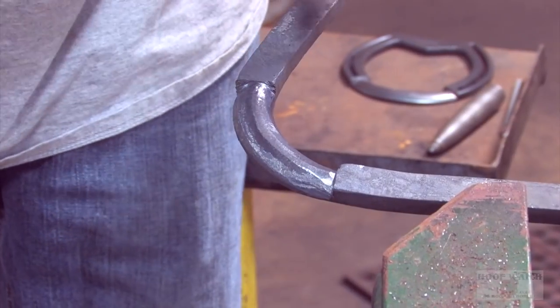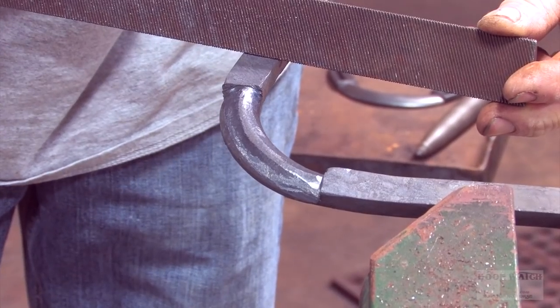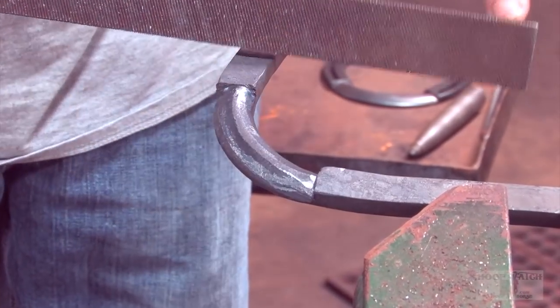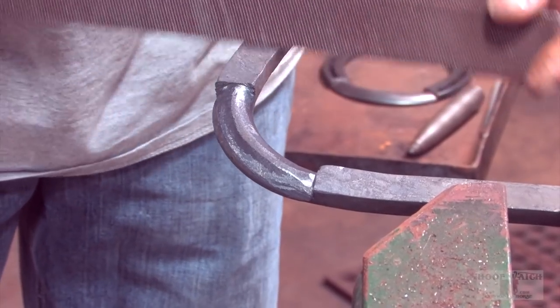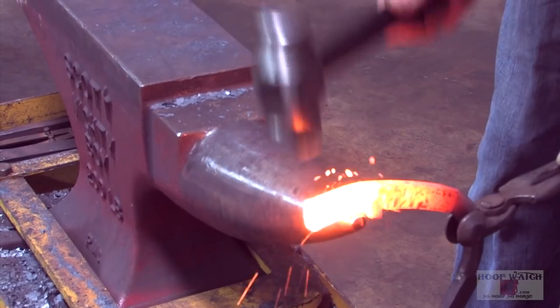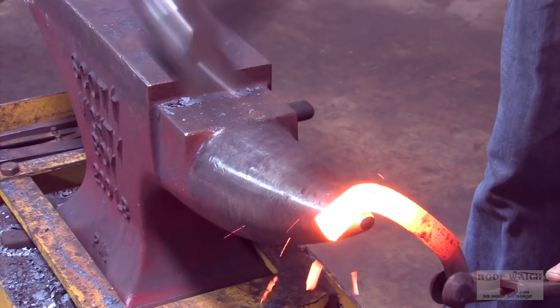The one thing is when you bump, I have my bump going to about here. So now whenever I fuller, I can crispen up those edges coming from the other direction and remove material and make that nice and flat and crisp. About 1 1/2 inches. Make a nice, crisp, acute bend.